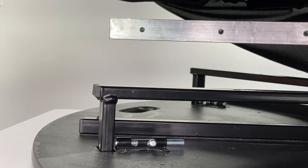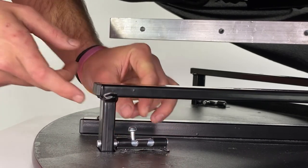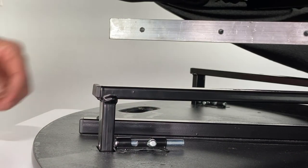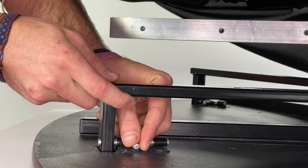Always test the safety of your rotation at slower speeds before accelerating the unit. To move the unit from transport mode to isolation mode, move each of the six barrel bolts on the OrcaView legs to the unlocked position. To move the unit back into transport mode, while the unit is still on the floor, gently lift each leg and move the barrel bolt back to the locked position.